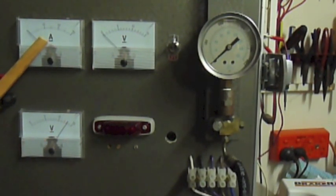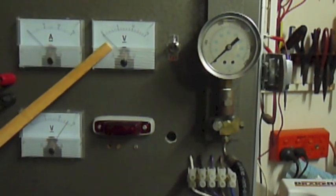Here is the current that will be coming to the motor on our electro-hydraulic brake controller, or the BrakeRite unit, and this is the voltage. This is the signal going down your blue line or your braking line, which is driving our brake controller itself.